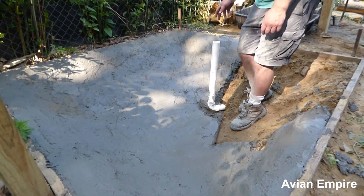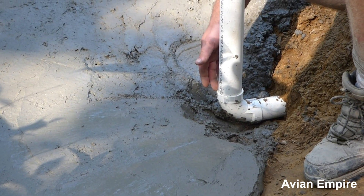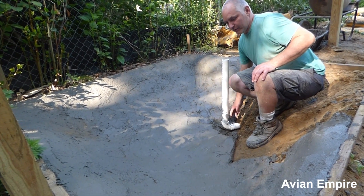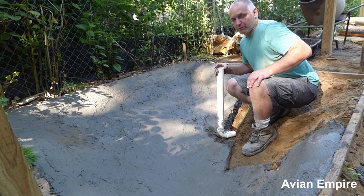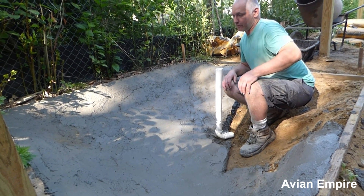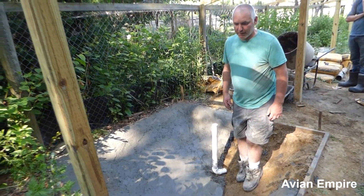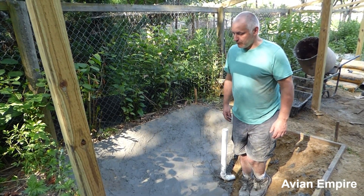We're in the process of packing concrete around this drain pipe right up to the top of the opening. If you're using a concrete truck, a lot of times you'll have concrete come right down to the top and it's uncontrollable. If there are bigger ponds, you might have concrete come up on this pipe. In that case, we let the concrete dry for a couple of hours, then wiggle this pipe around, make the hole a little bigger, and pull it out. In extreme cases we get the hammer drill out. But the best thing is just to pull the pipe.